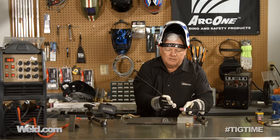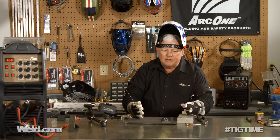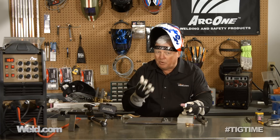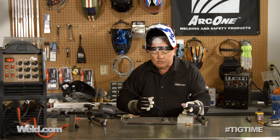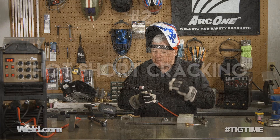Overall, that's probably the right setting. I'm going to go ahead and terminate the weld, backing off very slowly because it has a tendency to create a crack if you don't. So 3/32 is the right selection. Take a look at the tungsten — it may have balled back a little bit, but not very much, so it sustained the point. It also allowed the arc to stay very, very tight. In aluminum welding it's always really hard to get a small weld, so grinding it to a point using an inverter style machine is an advantage.